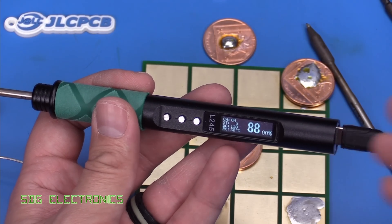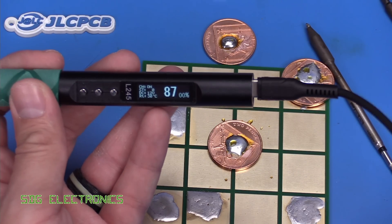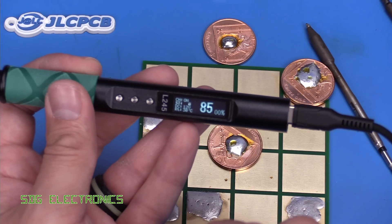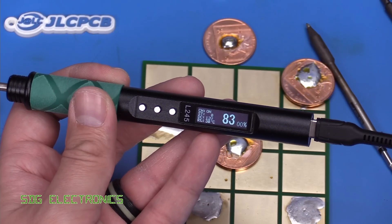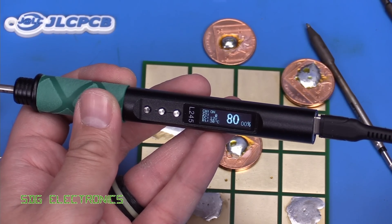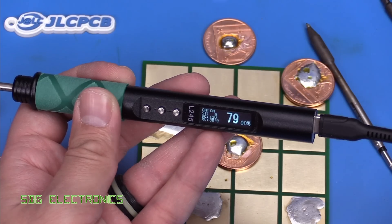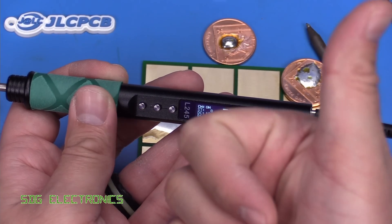You probably could run it at full power using the DC input — just get a USB-C cable, disconnect the communications lines, run the two power lines from a DC power supply, and tweak it to get the maximum 65 watts, though it's a little bit fiddly. I'll put a link to this item in the description if you're interested — it's quite a decent price point. I hope you enjoyed the video. Big thank you to my sponsor JLCPCB, and also to my Patreon supporters who really keep the channel going. Until next time, thanks for watching.